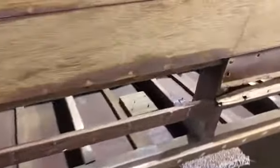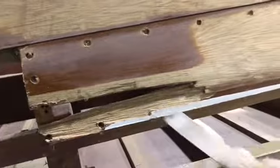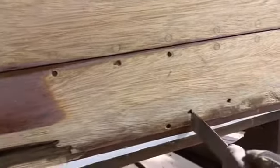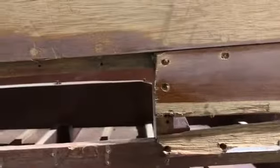Same thing on this side — rot here because it wasn't done properly. This bottom plank will be butt-jointed in up the front, and this one here we'll find a section and run a new plank to the transom. That's that side.